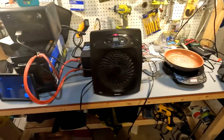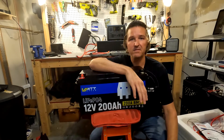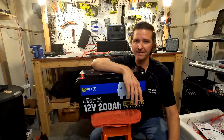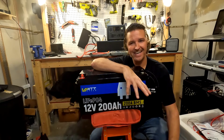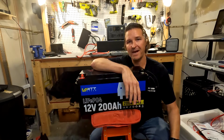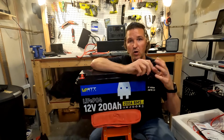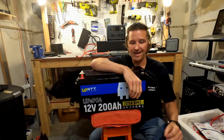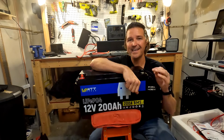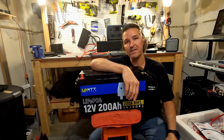Now that we know it can handle 200 amps with no problem and can actually sustain 350 amps for several minutes — the power is there — but the BMS should have shut off before the wiring reached dangerous levels. The over-amperage protection did not kick in, and I don't feel safe about that. The 200-amp continuous rating passed, but over-amperage protection, in my book, did not pass.